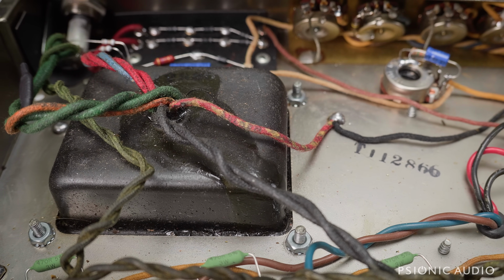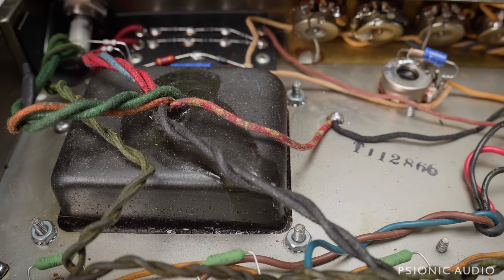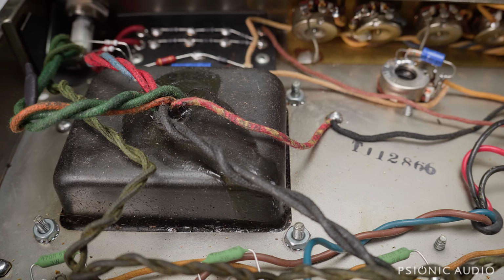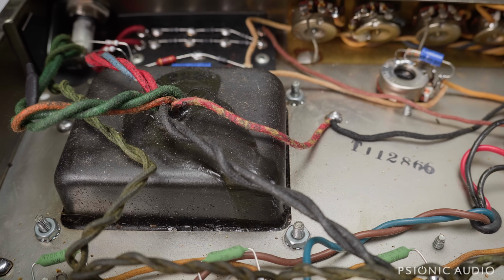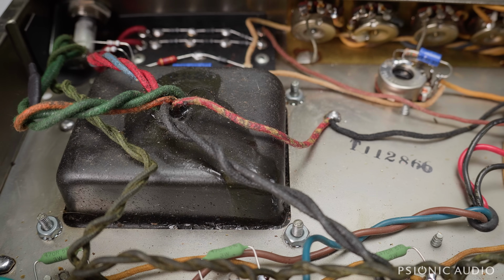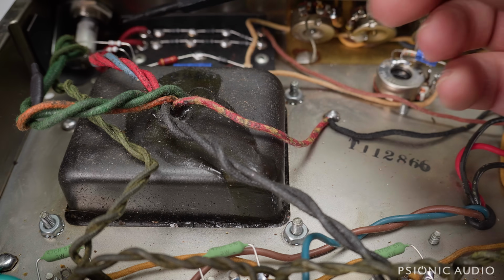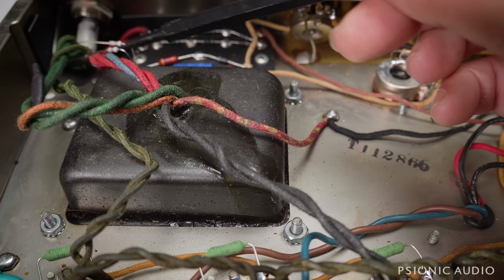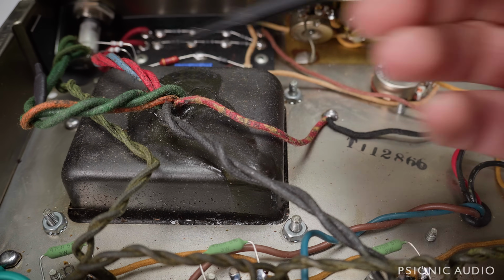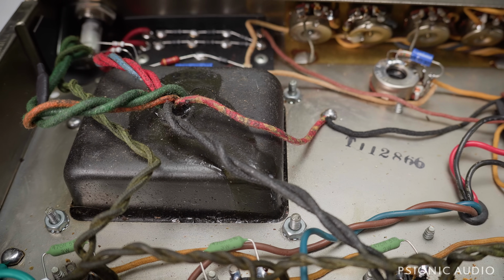In some modern amps, they put fuses on the heater supply. The trouble with fusing a heater supply is that there's an onrush current through normal operation when you power the amp on, which usually will blow a heater fuse, even when in steady operation everything's still within specs. So it's really tricky to fuse a heater supply reliably and not have a bunch of false failures, which can ruin a gig. These won't fail under limited overcurrent condition, but when you get enough of a current draw that you would have damage to the power transformer, these little things will just open up, and then the problem will go away most of the time.